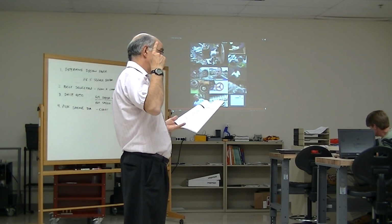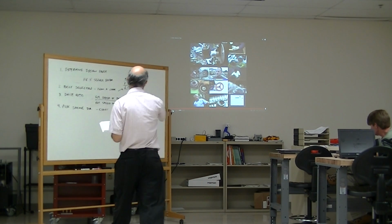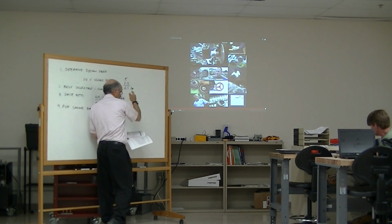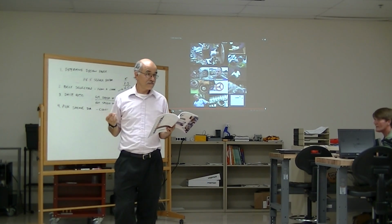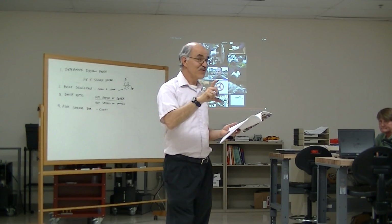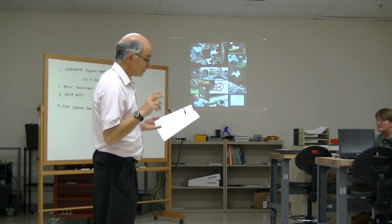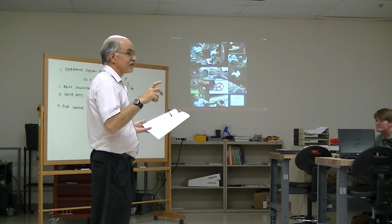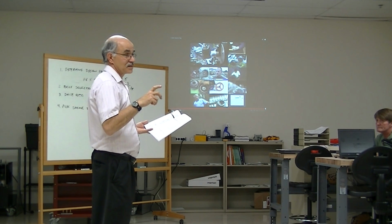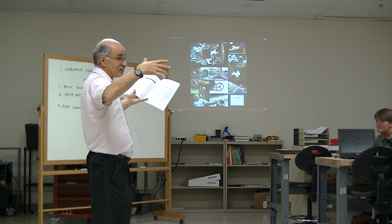You need a sheave that is both strong enough and large enough to meet the horsepower requirements. Remember, here's our horsepower requirement up here, 6.5 horsepower. You want to use the fewest number of grooves possible. If you can get away with one groove, that's what you want to use. Cheaper and fewer belts, right? You also want to use the smallest diameter sheave that'll meet the requirements. You don't want to put these big sheaves on if you don't need them.